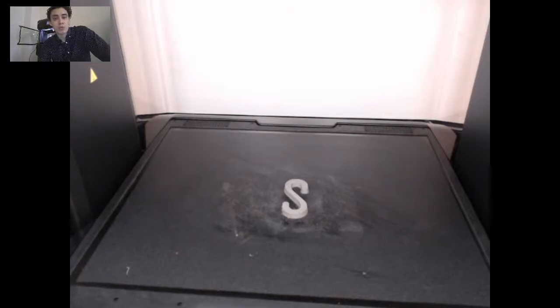Would it be appropriate for low volume automotive production? How does the final part cost compare to metal injection molding or traditional casting? The answer is, as always, sorry, but it depends. So yes, it would 100% be a great option for low production parts. For instance, this particular part, we made the estimate, and the finished part comes at about $30, maybe $40 with the post-processing and sintering process included. And that's as part of a larger batch.